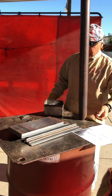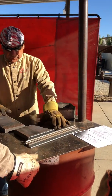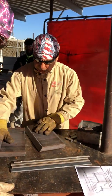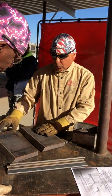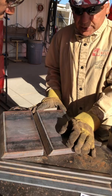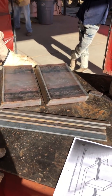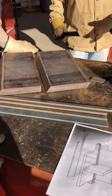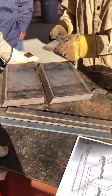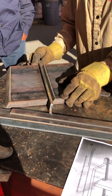You're going to put this configuration together like this. One side is cut square, the other side is cut at a 30 degree angle. You're going to have a 3/8 inch gap, or root opening. We have flat bars that are going to be used for backing — quarter inch by one. The one you're going to use for gapping it, getting your root space — your root opening is going to be 3/8 inch.